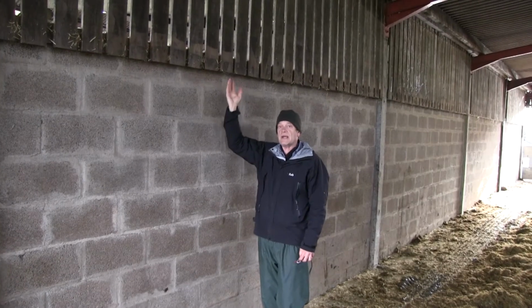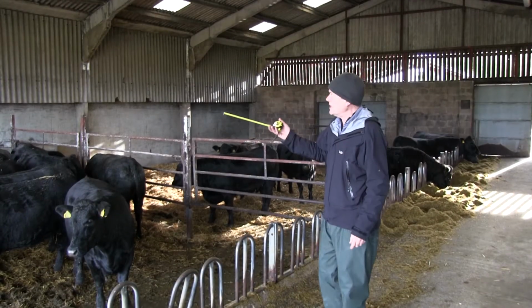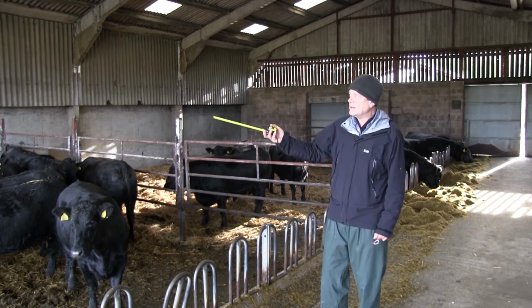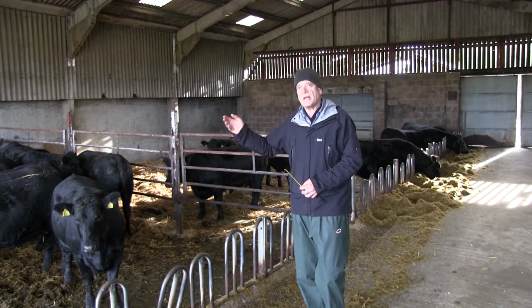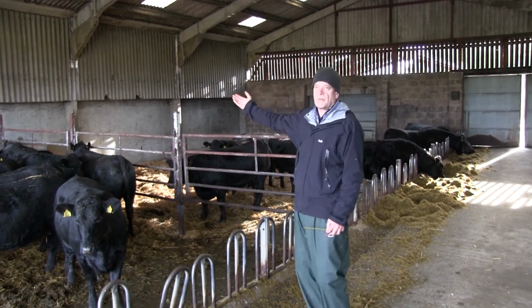I've done some basic calculations, doing that and doing that. On the other side over here, it's solid to an adjacent building. If for any reason that can't be opened up, then maybe on a site that is not as exposed as this and well ventilated by the wind, you might need to put a fan and a duct, because you can't get fresh air through a solid wall.